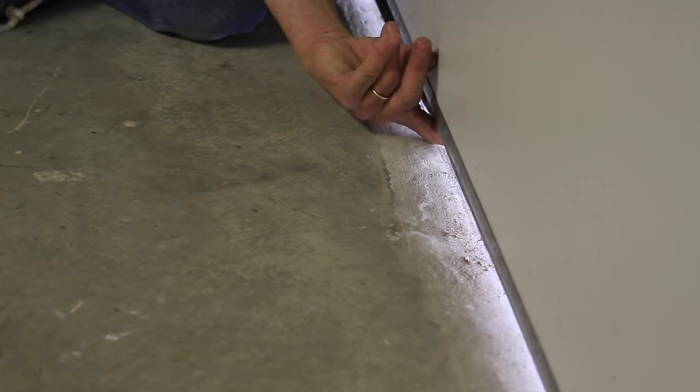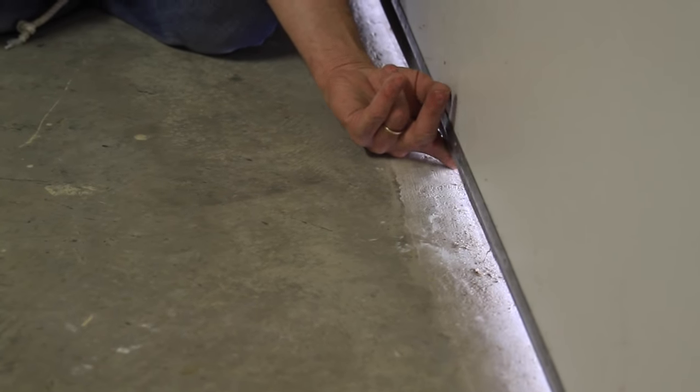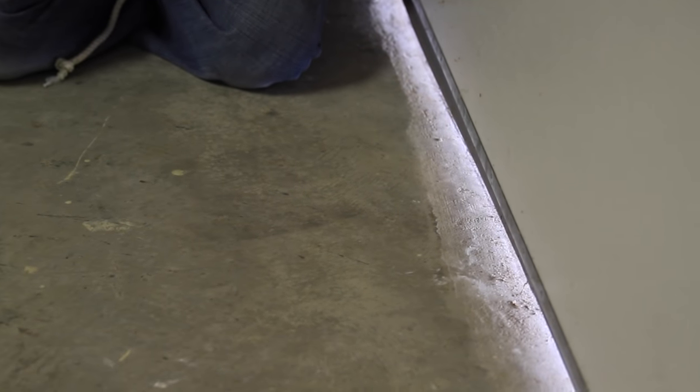Now, you can have the door a quarter inch off the floor and it can be raining monsoons outside — water will not come in this crack. A lot of people make this a multifunction room where they don't want water coming in, so it's important that you profile your concrete right so you have a nice dry room.